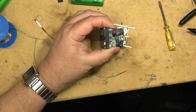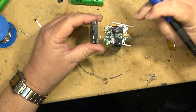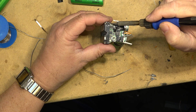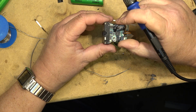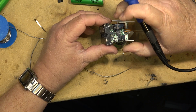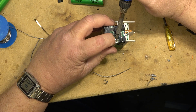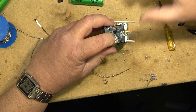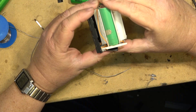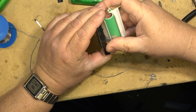Let's see if I can solder these tabs down without burning myself too badly. There's one battery terminal on — there's the other one — and the temperature sensor which goes over here. That's the over-temp warning. Now let's just see whether I'm able to stuff this together, put the back on it, plug it onto the charger and see what it does.